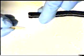Turn the endoscope over if necessary in order to reach complete 360 degrees. Again, any epoxy that has leaked previously underneath the Scotch tape joints can be easily cleaned away with a toothpick and a paper towel. On smaller instruments, you can use just the toothpick and some alcohol and clean up to the glue joint to make a nice, smooth, clean edge.